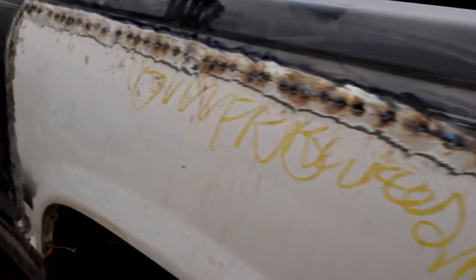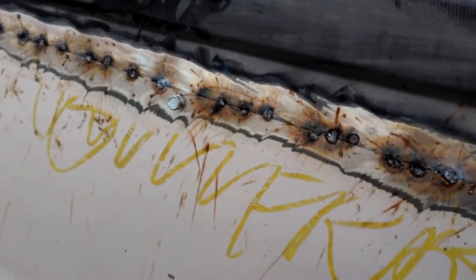Alright, the bead shooting is complete. Look at those awesome welds. This is the part where you go in the comments and tell me how shitty my welds are — and I'll agree with you, because they definitely are. I can't completely blame it on the welder; it definitely doesn't help. But it's on there. One thing to remember when you're doing this: you just want to make tack welds so as not to heat up the two panels too much and warp them. And you want to kind of move around, like you saw me doing when I was welding.